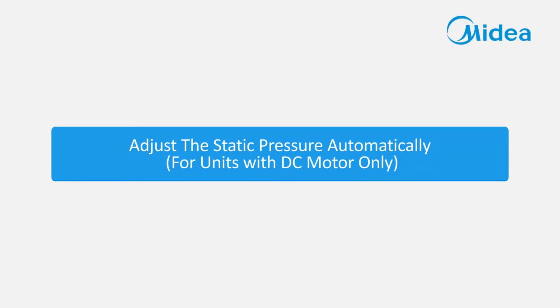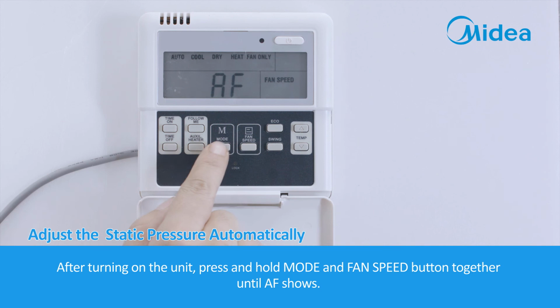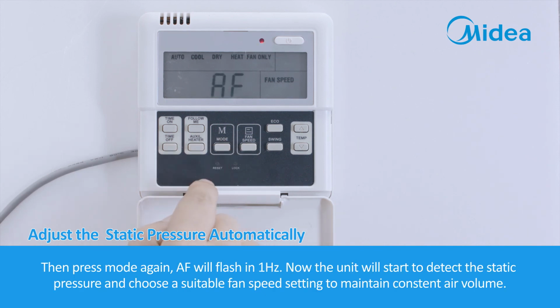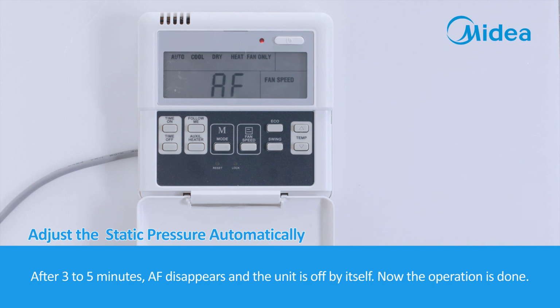Adjust the air volume with regard to static pressure automatically, for units with DC motor only. After turning on the unit, press and hold the mode and fan speed buttons together until AF shows, then press mode again. AF will flash at 1 Hz. Now the unit will start to detect the static pressure and choose a suitable fan speed setting to maintain constant air volume. After 3 to 5 minutes, AF disappears and the unit turns off by itself. Now the operation is done.